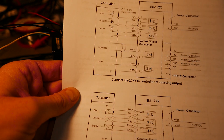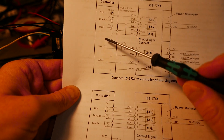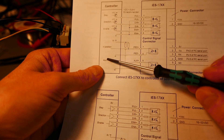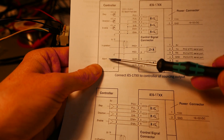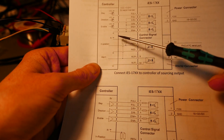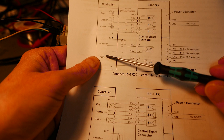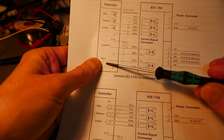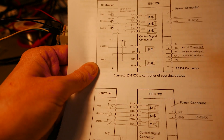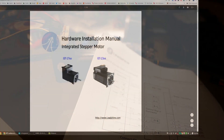It's not working reliably at 3.3 volts — I first tried with an Arduino Due but that gives 3.3-volt signals, so I'll use an Arduino Uno instead. The interesting thing with this motor is that it has in-position and alarm signals. When it reaches the target position it sends an in-position signal, and if the motor loses steps it pulls the alarm signal low, so it can stop your operation. This means you can drive it to the maximum without being afraid it will lose steps.